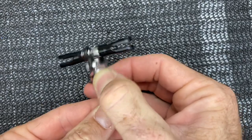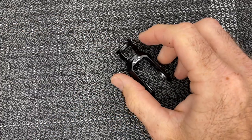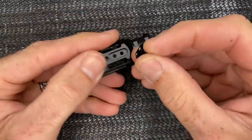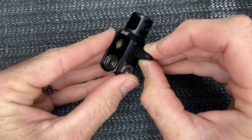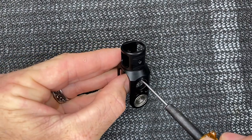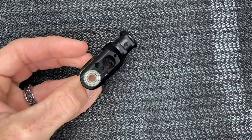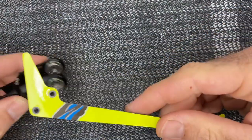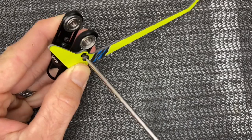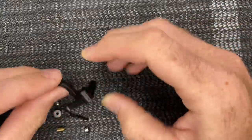Now for the tail casing assembly. Take the tail casing lip, insert it into the groove with the lip side facing down, then insert screws through the back — 1.5mm driver, blue loctite, tighten both down. Apply the vinyl decal to the tail fin, then mount the fin using a 2mm driver with loctite — one screw here and one there.